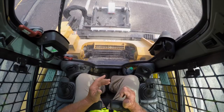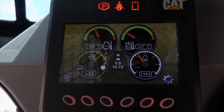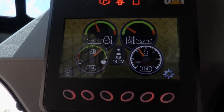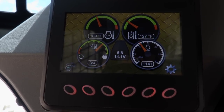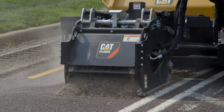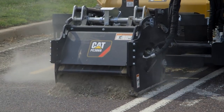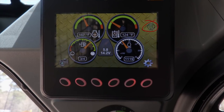Machine started up. On the right-hand side of the headliner, four switches back is the continuous flow function. Hit that one time when the machine is running and it will activate, indicating it is ready for continuous flow. To engage continuous flow, which will run the head of your PC-306B, take the roller switch on your right hand and roll it up all the way, holding it for about three seconds until the light on the advanced machine display goes from flashing to solid. That allows the operator to take his thumb off the controller.